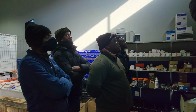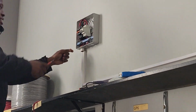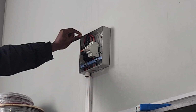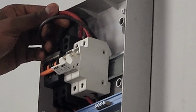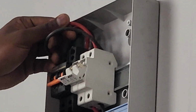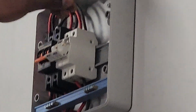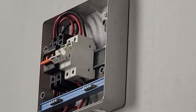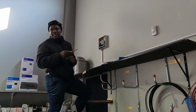Smart. Yeah. And then make sure you also inspect for anything else. Check if the cables are properly tightened. Check all these connections if they are properly tightened. Check if there's any discoloration on the cable, because that can also be a good sign that the cable is taking much of a strain. If there's any breach piece, check at the top if it's really catching, because sometimes it's tightened but the breach piece is actually sitting behind.